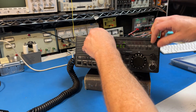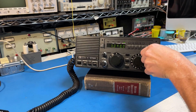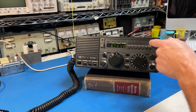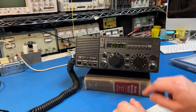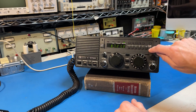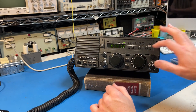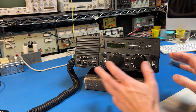If you want a different channel you can unscrew this panel and just type in a different frequency. For example, 8.7213 megahertz — press RX, now we're receiving there. Then you also have to program in the transmit frequency: type in the same number again, 8.7213, press TX. Now both have been programmed in, and you can press this button to verify the transmit frequency matches receive. There's also a mod I'll explain later that lets you program only the receive frequency and the radio automatically transmits on the same frequency — it's very easy to do.